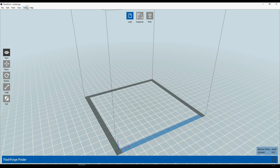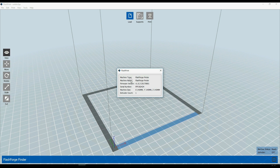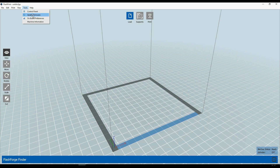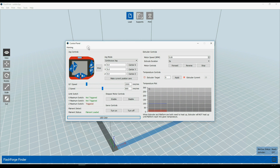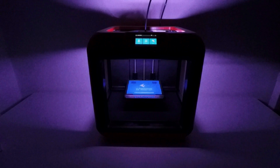Here you can change the name of the printer if you want. Here is some information about your printer itself and the control panel. You can move your printer around on every axis, change the jog move to continuous or not continuous, center the X, Y or Z axis, make the current position zero, change X, Y and Z speeds, and enable or disable stepper motors including the servo. And here you can change the LED color to any color that you like — if you can't find your color, you can make one.